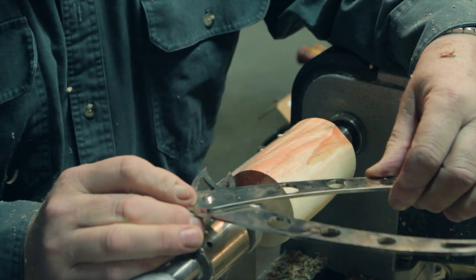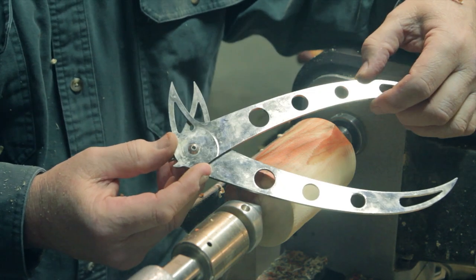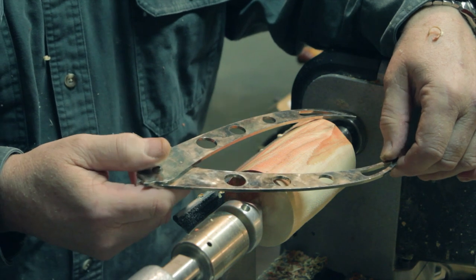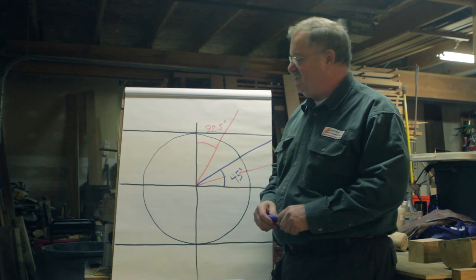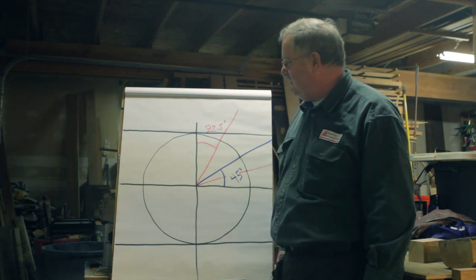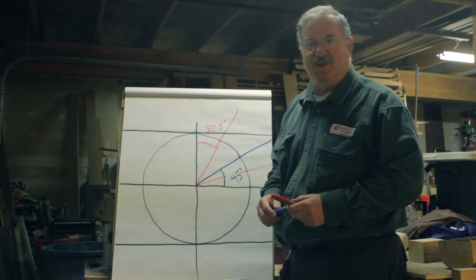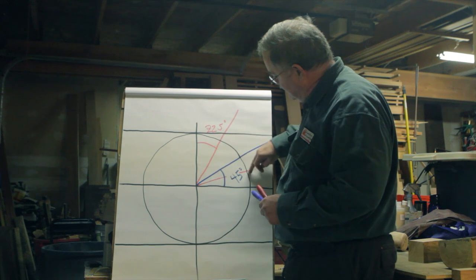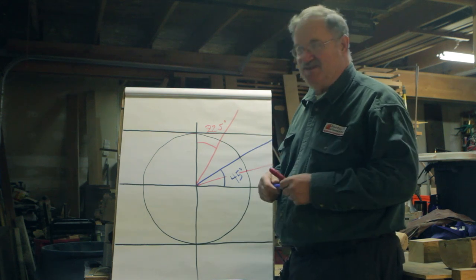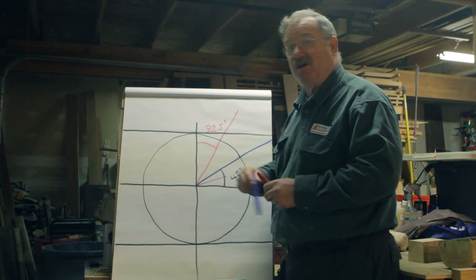The Berger Sphere Caliper is not essential for turning spheres, but it makes it a lot easier, particularly for someone just beginning. The caliper will set in steel the location of critical dimensions. If you think about a sphere as simply a spherical object trapped in a piece of wood, your goal in turning is to release it. Most people end up making smaller spheres than they wanted because they cut away too much of the outside shape. If we can preserve critical dimensions, we have a better chance of winding up with a sphere close to the size we wanted.